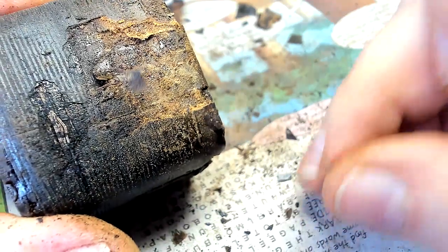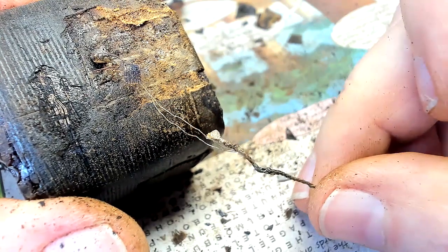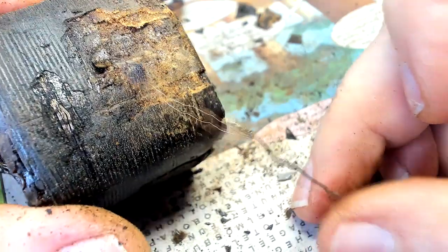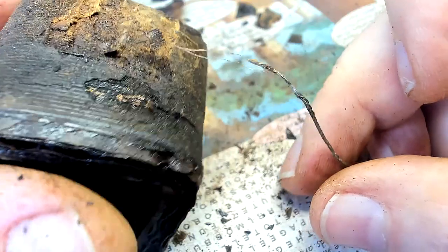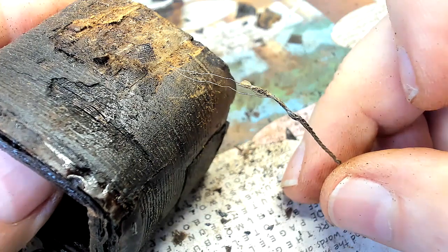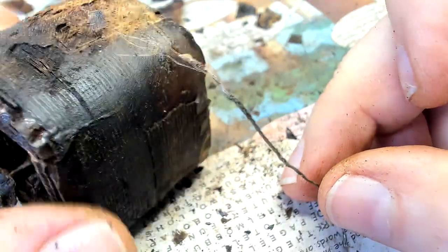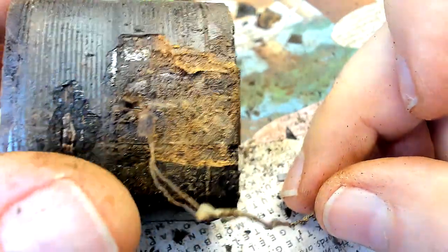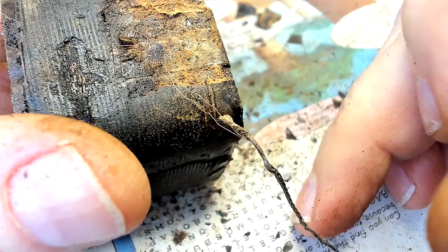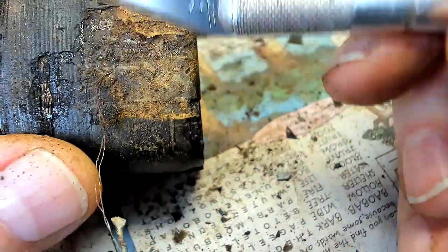You think this was the center tap? Since it was pinched in there on the clamshell, that would ground it to the chassis. You're not as stupid as I thought. You might even be intelligent. You know, I think that's what it was. That 400 ohms was a reading from one of the legs of the high voltage to the center tap, which is 400 ohms. I think the mystery's solved. We just had to open high voltage winding from point A to point B, but the center tap was still connected. That's got to be it.